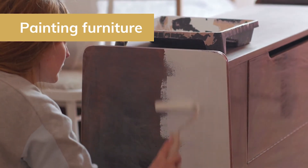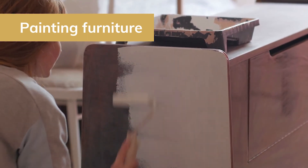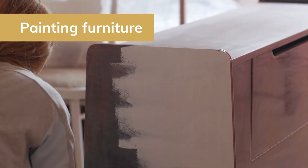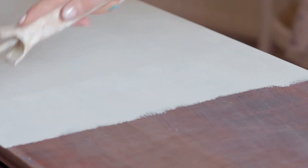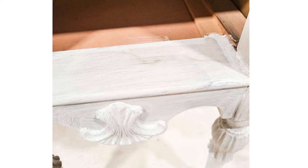How about furniture? It is usually recommended to prime furniture before painting, but it's not absolutely necessary every time. It truly depends on the type of furniture you're painting, the paint, and the color. If you're painting on stained wood, the stain may bleed through on the paint, so definitely keep this in mind. I like to test a small and inconspicuous area on the furniture first, or if you're feeling like it, just prime everything anyway. Here's a quick example: I was painting a vintage desk with chalk paint and I skipped primer, and about halfway through the first coat I noticed all these stains poking through. So I quickly pivoted and added a coat or two of primer before moving on.